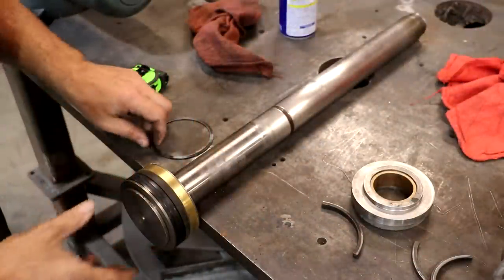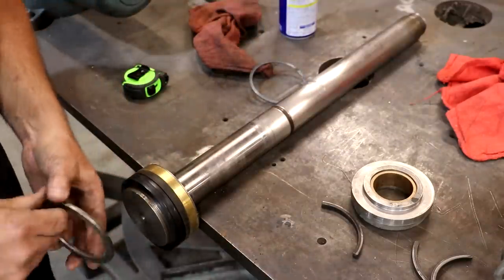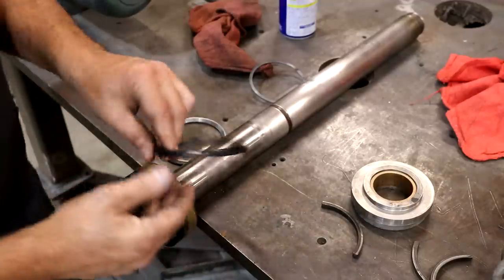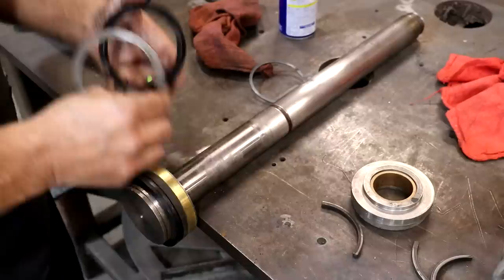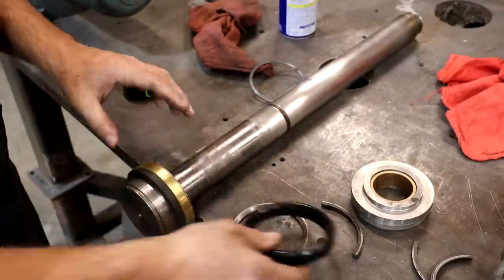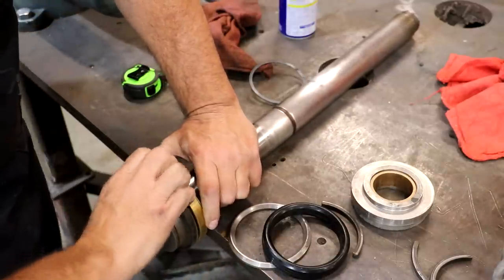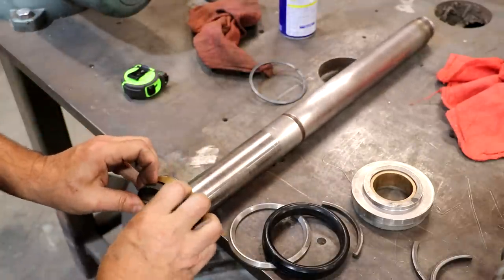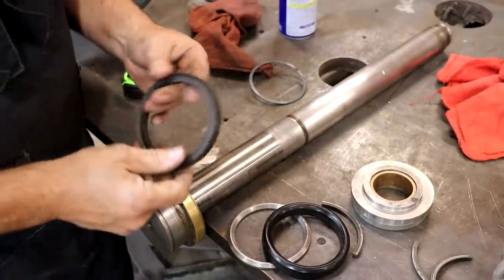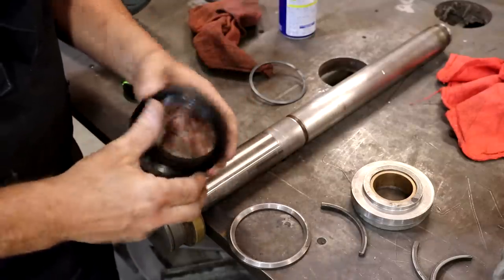Next I want to pull the seals off. There is a retaining ring — I've already got that off. Then you've got a steel disc with the profile of these rings. The rings are seals — they're kind of V shaped, matching the V shape in the profile. They stack on top of one another. There are three of these, and then there's another one that's flat on top made out of a different material, kind of a canvas type. I'm going to go ahead and get that one pulled off as well. We're going to replace all these — I've got new ones. The material's a little bit different but basically the same.